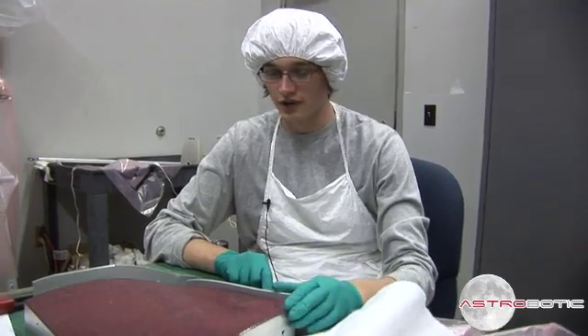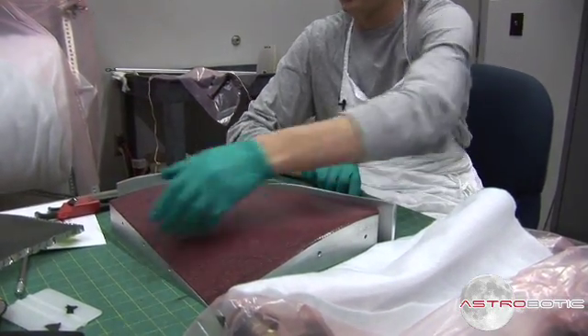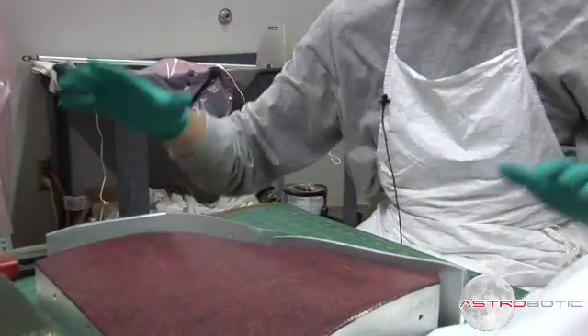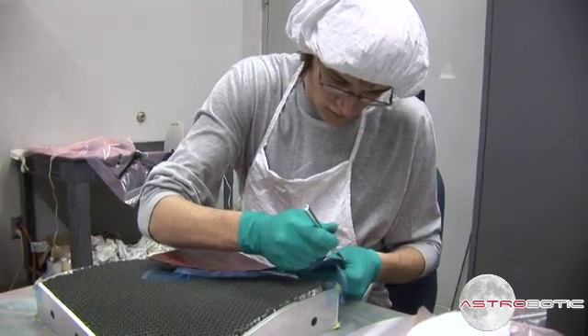This is the mold for the complex curve. Right now we have one layer of carbon down on here. We're going to put this honeycomb on top of it, and then another layer of carbon on there. We have these to sandwich it in so that the cells on the sides don't collapse under the vacuum bag.